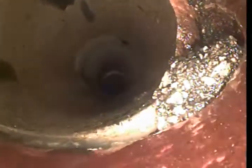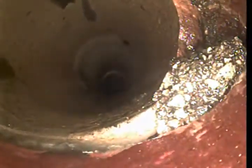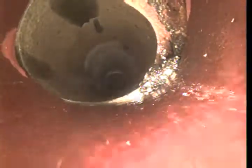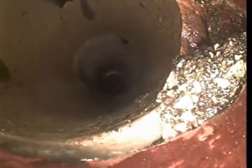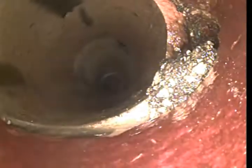you can see the pipe is shifting or has shifted, and the concrete that bonded the pipe, as a result of age, is wearing out, and you can see the clay pipe is broken on that section right here, and the concrete that's holding the clay pipe is wearing out.